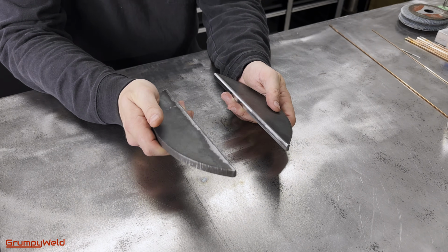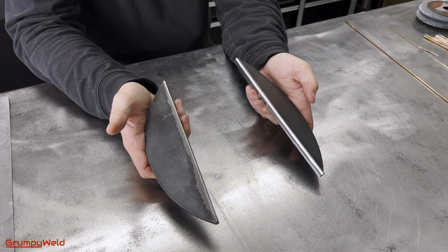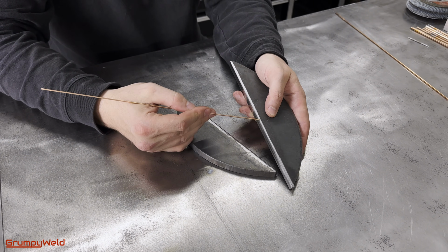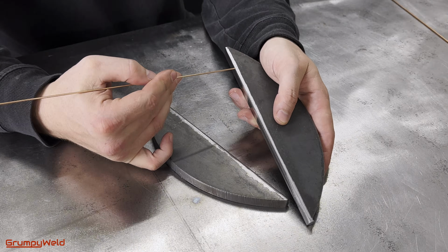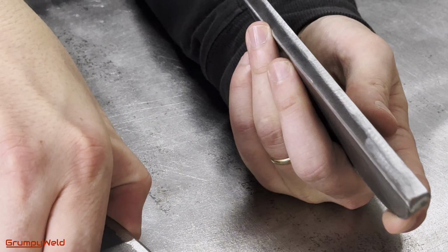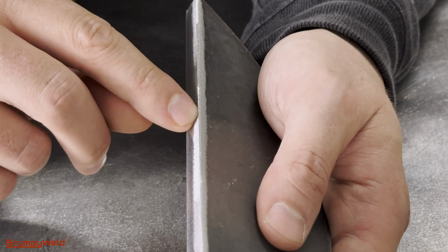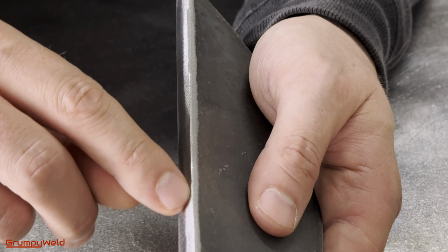All you need is 2 pieces of scrap plate. Clean up the faces and around the edges so the metal is shiny silver. You don't need anything fancy. Anything from a 1/4 inch to a 1/2 inch thick will work well. Keep the corner edges sharp and square. These become your bevel edges on the root.